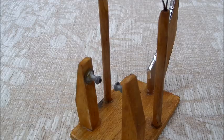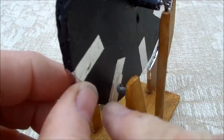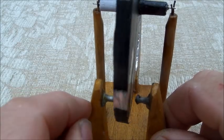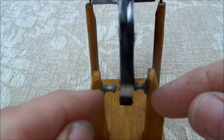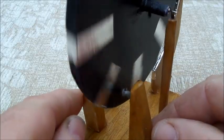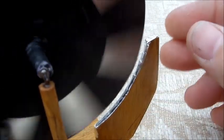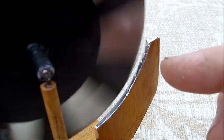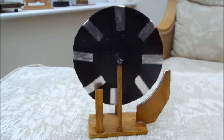When I place the disc into the caddie like this, you can see that these little studs — these pointy conductors — come very close to but do not quite touch the wheel. The result is that charges accumulating on the tip of these points draw electrons out of the aluminium plates, causing the aluminium to become positively charged on this side. The opposite is occurring on the other side, because this is not a pointy conductor — this is a little concave strip aligned in the direction of the turn of the wheel. The force is always to turn the wheel in that direction.